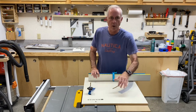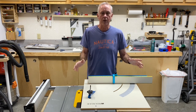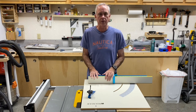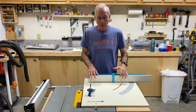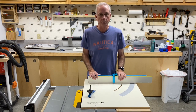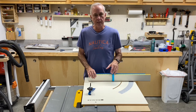I built this side wing quite some time ago because when I was cutting wider material, it was just too sloppy and I wasn't very accurate — just like this board, it kept wanting to tip off the table. I built this a few years ago and it's worked great. It's really flat with my saw table, which is why this Rockler cross-cut sled slides so smoothly across it. I've got a video referenced here if you want to see how I made that side wing — I think it's absolutely essential if you want to have this cross-cut sled.